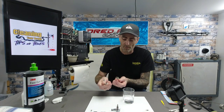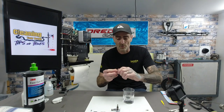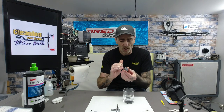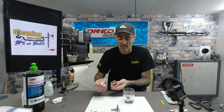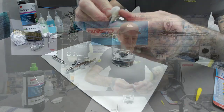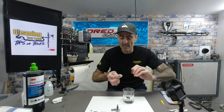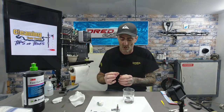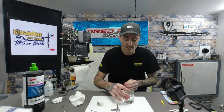That needle is really shiny now — you can feel the difference, no drag at all. On the Takumi you can take the lid off the top and soak it. The bottom part of the cup unscrews to give you that bottom piece. This one has a little washer so I wouldn't drop it into thinners — instead, get a cotton wool pad, wipe the cup out, and pinch around the end to clean all the dirt off the thread. Give it a wipe with kitchen towel and the cup is nice and clean.